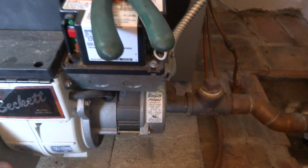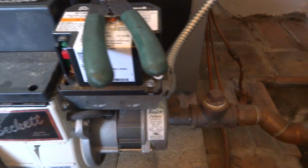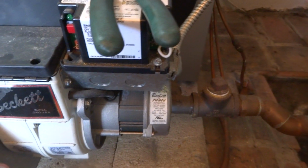So in other words, this boiler's been calling for heat continuously, running up to high limit and shutting off on high limit. Yeah. But even if the thermostats aren't calling, this thing's still going to stay 190 degrees all summer long. Yeah, okay, great. Well, crazy. Glad it sticks. Thank you.